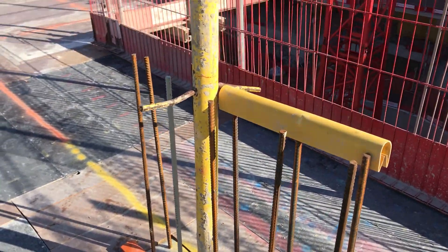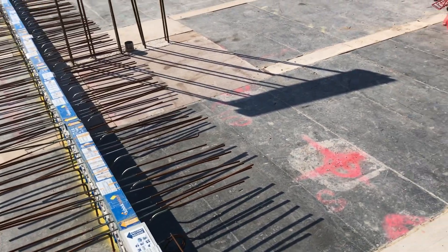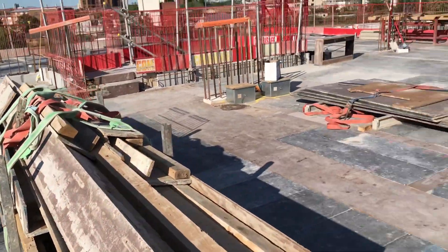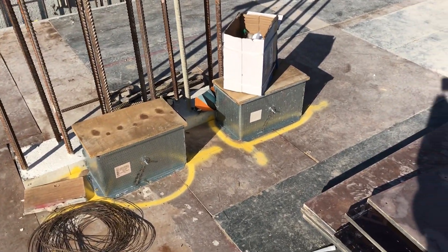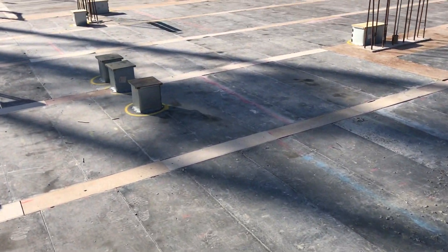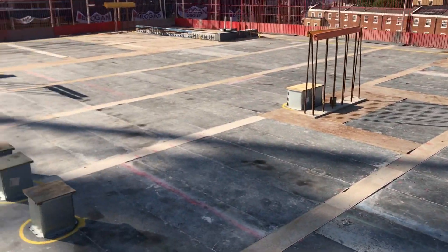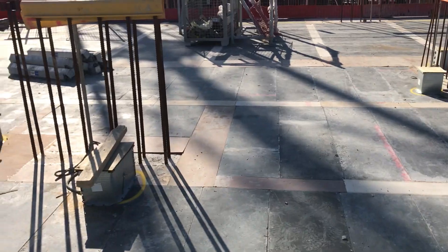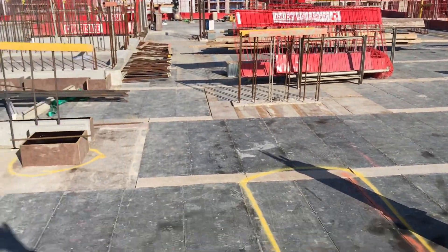As I showed you, that's the survey board for the instrument and you're going to be setting out the lines, all the boxes, and everything - the balconies, lines for the balconies, all the stuff. As soon as you can get in, you're going to be marking all this - all the boxes, everything is on the GA drawing. The prick is already in here and we've got the boxes. The main job is to set the slab edges, which gives a start for the fixers and chippies to install the balcony connectors. You can also do a spot check of the decking level with your EDM as this will be your soffit.